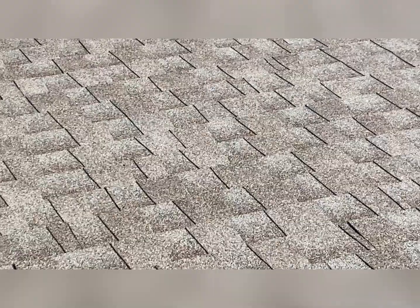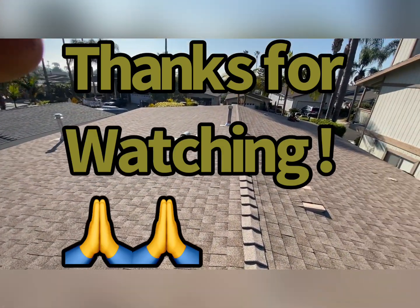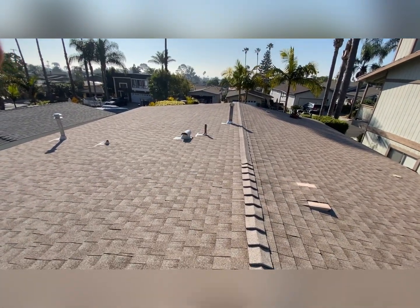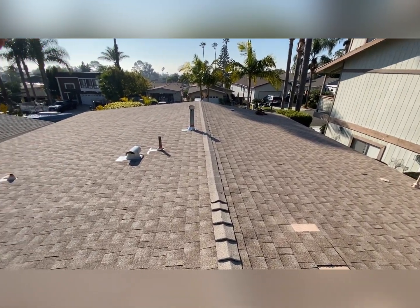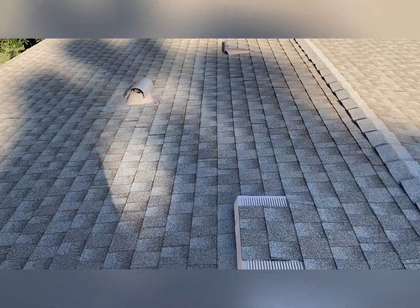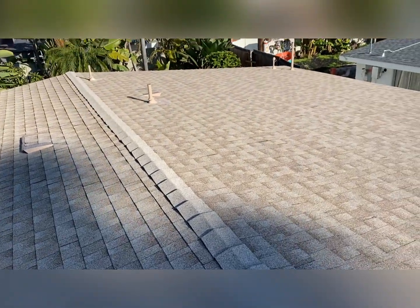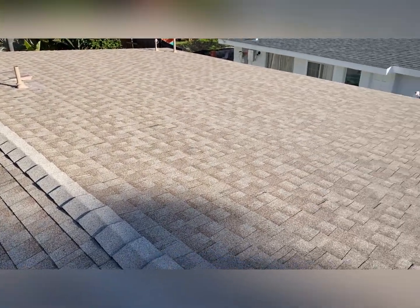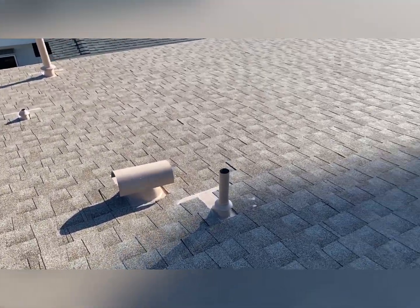This is how I finish it. I'm making this video to show how I do it. I don't care how you do it, but I always install one layer of self-adhesive underlayment on low-slope roofs that don't meet the minimum requirements, because it's a risk if you install two layers of 15-pound or 30-pound felt - eventually it's going to leak. So don't play games. It's going to cost you a little bit more but you're going to be safe. Thanks for watching.